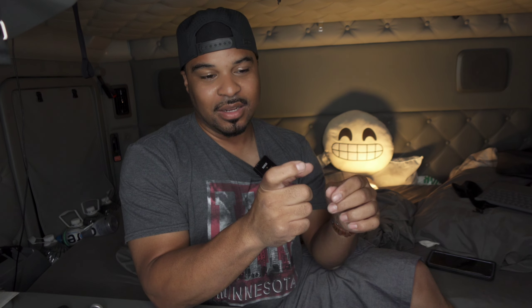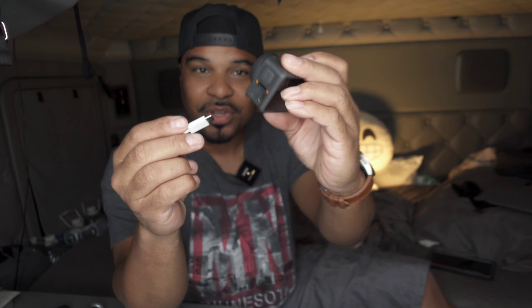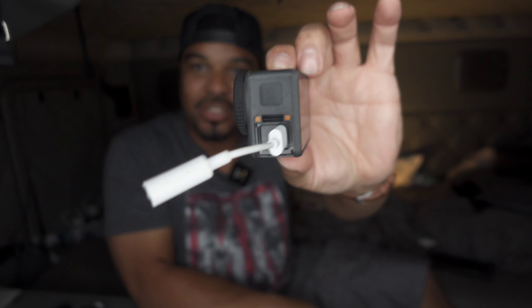For the DJI Action 3, you would use the RODE SC3 adapter cable. You plug the Senna cable's 3.5mm end into the RODE SC3 cable into the female end. Then the TRS side of the RODE cable plugs into a 3.5mm to USB-C cable — the 3.5mm end is a TRS input and it goes to a TRRS output. That TRRS end goes into the Action 3. You can remove the door if you need access to it, and now you have a full moto vlog setup.